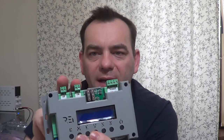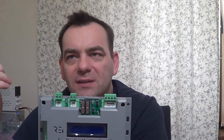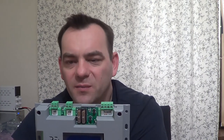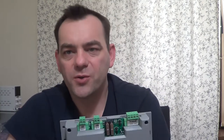You can straight connect DC motors here — let's say 7-8 Amperes, which is pretty good. 10 Amperes is max, but I recommend that if you are building a tracker, it is a pretty slow device. If you want to use DC motors stronger than 8 Amperes, that means you have to change your mechanical configuration, because maybe it's too fast or you're losing too much power. The tracker can handle about 10 kilowatt peak on one tracker, and it should have two motors with a maximum of about 100 watts — that's good enough for the small motion of a solar tracker.